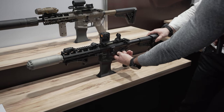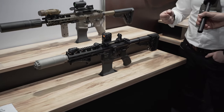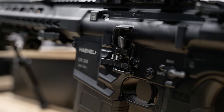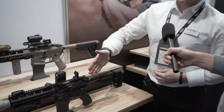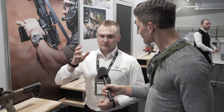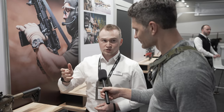Talk to me about these pins for the fire control unit — they're pretty robust. They are full-sized pins, and the second thing is they are captured — similar to anti-walk pins in ARs, but secured by a flat face on one side and a washer on the left side. So if the weapon is shot a lot and vibrates, they don't walk out. Standard AR pins have two grooves, which are potential breaking points. Our pins are solid and secured on both the left and right side — more sturdy, more robust, and they don't break or walk out.